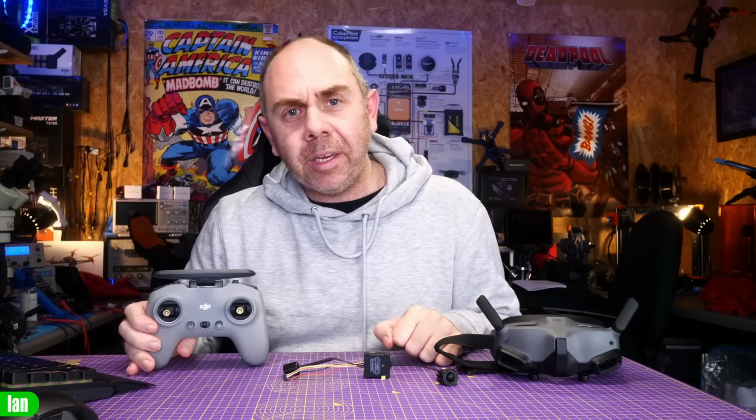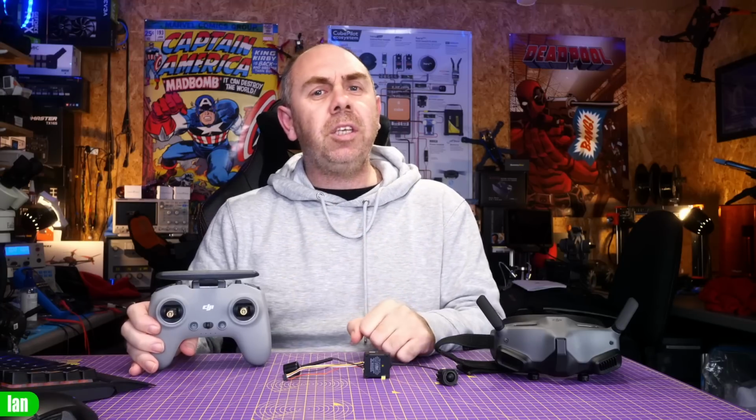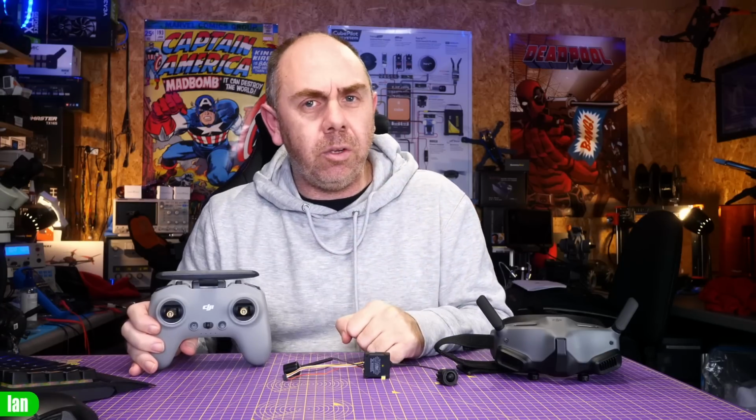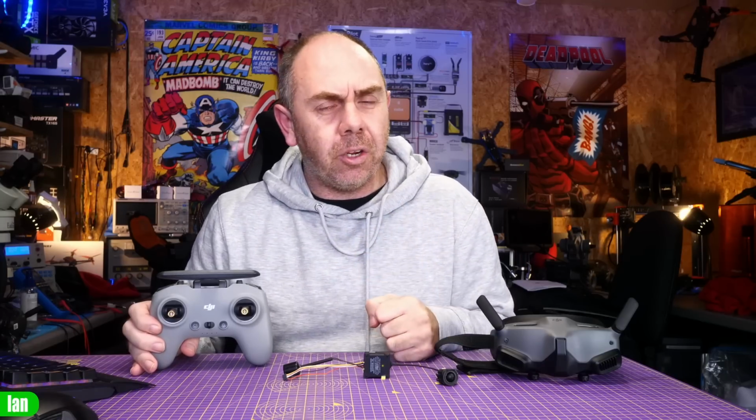What I mean by that is, at the point of you losing video signal, you lose control from the goggles and the remote to the drone. However, if the video signal doesn't return after roughly 5 seconds, the remote seems to change channel and then reconnect to the air unit. The bizarre thing about the behavior of this is what will happen in a signal loss is you will lose control, then after 5 seconds regain control.